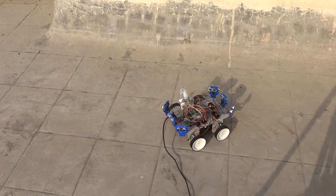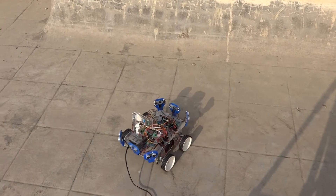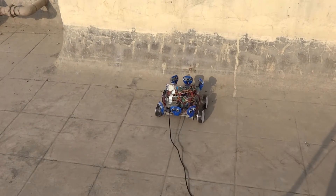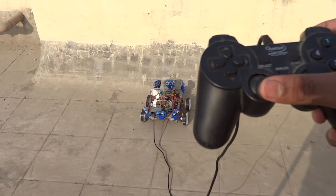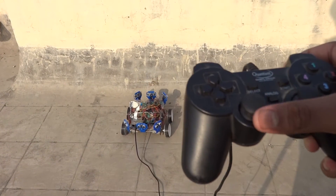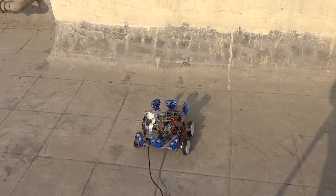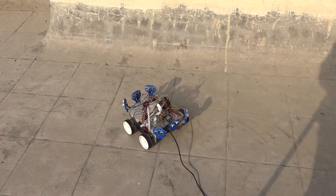Let's test what these sensors are capable of. First, the center sensor at the front is there to stop the robot from going further if there's an obstacle. As you can see on my controller, when I move it forward it stops automatically. One thing to notice is that it works pretty well in sunlight — that's one problem with infrared object detectors: they don't work well in sunlight.